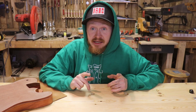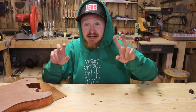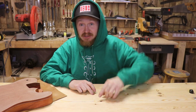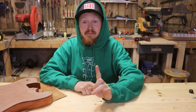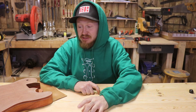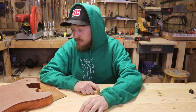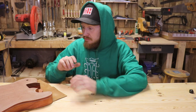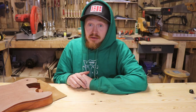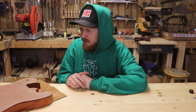But I gotta get the knobs recessed in, do the PRS style carve so that the knobs sit perfectly 90 degrees. If I just drill them in or put them on the carve, it would look ridiculous. So they all got to be recessed, and same with the toggle. So yeah, we'll set up the drill press here and we'll get those done.